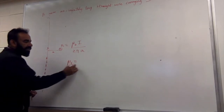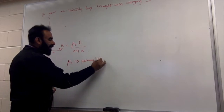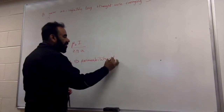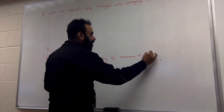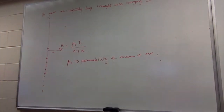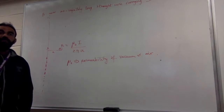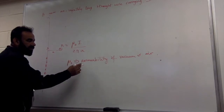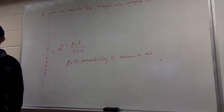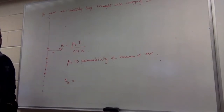Now, mu naught is called permeability of vacuum or air. For vacuum or air, it's approximately the same. And it's called permeability. What is the other constant that we saw in electric fields? Permittivity. So this is permittivity of vacuum or air.